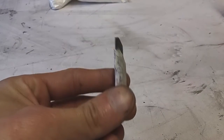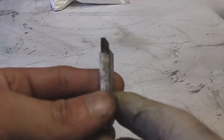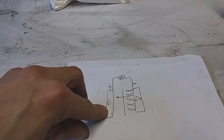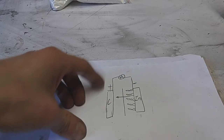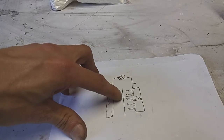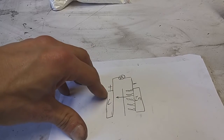So a lot of researchers or inventors making batteries use a sandwich design — this is the cathode, the separator, and anode — and put this all together. The problem is here is your cathode and here is your anode. If you recharge this cell, the zinc dendrites will form on the negative and will grow to the cathode.